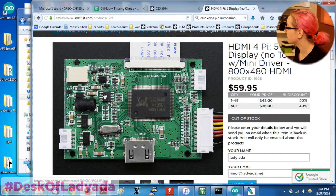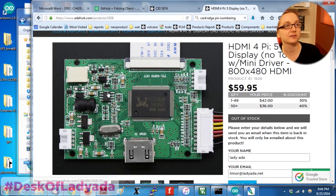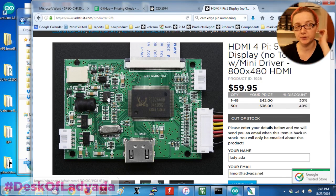And then this is interesting, this chip here. This eight-pin chip: especially with really low-cost microcontrollers, they don't have flash on the chip itself. It's not unusual for ASICs, processors that have a microcontroller base, to not have flash inside. Instead, the flash is external. So this is an 8-pin SPI flash chip, and you can just look up the part number. It's a 25LC something something.